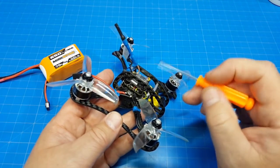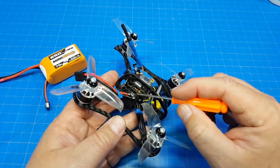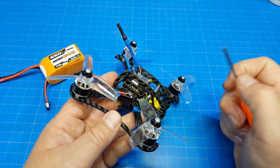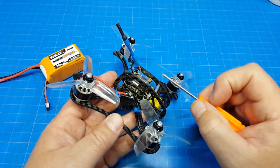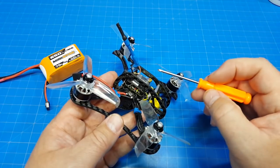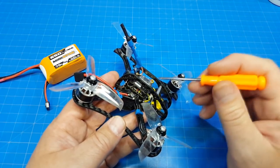If you don't want to use something like this, I would suggest getting a Spedix 4-in-1. You can get an Aikon 4-in-1 that's real small. You can just look on Race Day Quads or Pyrodrone and look at their micro stuff. And then the Matek 401 or the Matek 411 flight controller is a nice flight controller, and it comes with gummies, so the flight controller is already soft mounted, so that's kind of taken care of for you. They've also got brass inserts that you can put inside those.